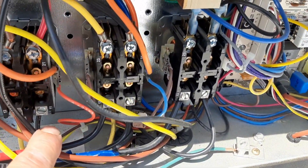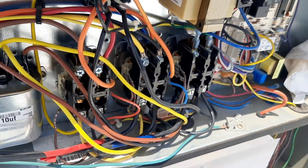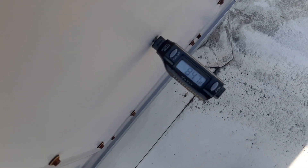Contactors probably need to go. They don't look awful. Everything's pulled in, so it's running. We'll get a temp drop on it, see how it's doing. 84.